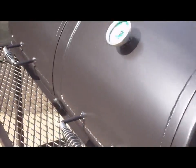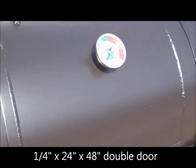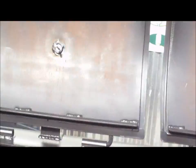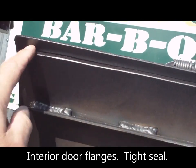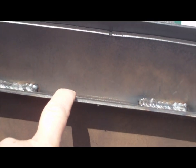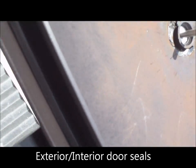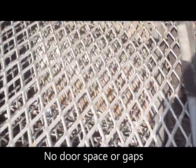Getting to the inside of this pit: you've got the double doors — 24-inch diameter by 48-inch long main chamber with two doors. You've got your flanging on the outside giving a nice tight seal, nice clean cuts, ground smooth welds. We've flanged it on the inside as well with additional flanging at the top and bottoms of the door seams for a nice tight seal. You've got your angle-frame sliding food trays that make it easy to access your meat.